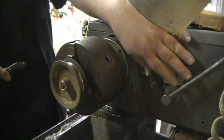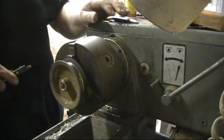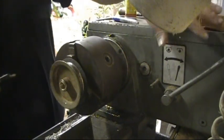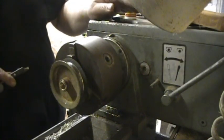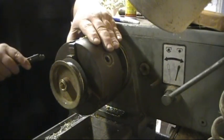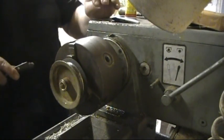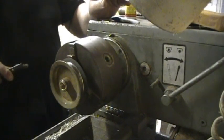But you've got to go back here and change this belt. It's got two belts in this old machine and a gearbox. I'm already in the high range of the gearbox — if I put it in the low range it'd be so slow it'd take 15 minutes to drill the hole. There's a belt back here on the motor that changes the RPM a little bit, and the one up here changes it quite a bit. There are three sets of pulleys up here, two back there, and a two-range gearbox. There are like 12 different combinations — we're somewhere in the middle. But it works.